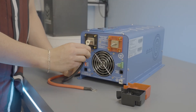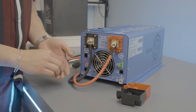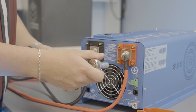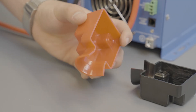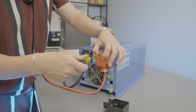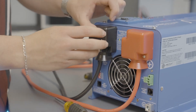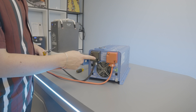Make sure to match the black cable to the black DC terminal for negative and the red cable to the red DC terminal for positive. Use a wrench to tighten the bolts to ensure a stable connection. Next, place the plastic cover over the red positive DC terminal and secure it with the screws. We will now do the same with the black negative cover. The covers are now securely in place.